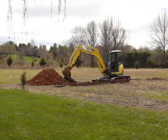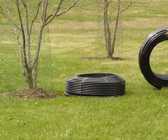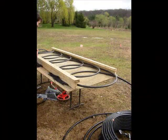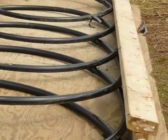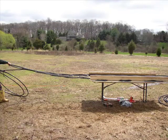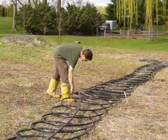Once we've determined exactly where the trenches are going to be, the digger has started to dig. He's going to be digging trenches 100 feet long, three feet wide, and six feet deep. Meanwhile, there needs to be some prep work done on these pipes. Underground loops are created from each coil using a rig to standardize the coil size. You'll see the loops just flattening out on the table and they're locked into place with cable ties.